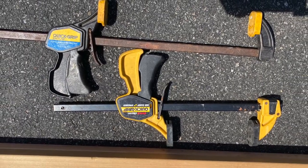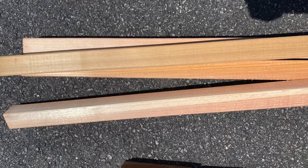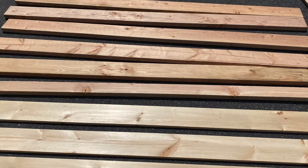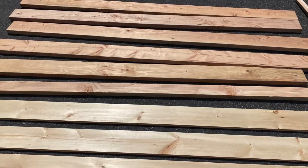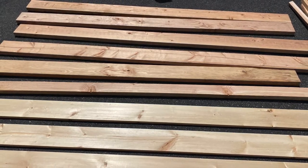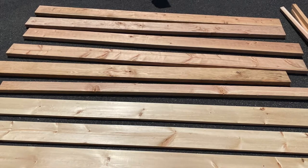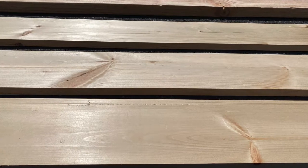You want some clamps — you'll need these when you're putting the bed together. These are two by twos; you can get them in about any length because you're going to be cutting them and putting them onto the long boards. Here you can see the lumber you're going to need: on top there's a two by six by eight feet — you'll need five of those for a queen bed, three for a twin. In the middle is the two by four, which will be used to make the feet. On the bottom we have one by fives, which are going to be used to make the planks.